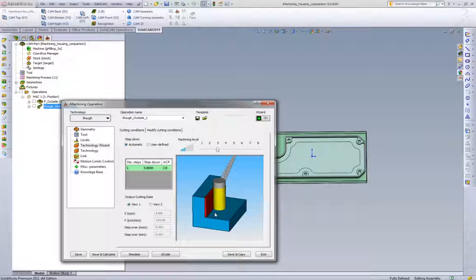When does the tool make the most heat? When it goes into the corners. We've all seen as the tool path runs into the corner, you can see it smoke up. We've all basically had the coolant just dripping on it, and we know as it's cutting around the outside, it's nice and fine. As soon as it goes into a corner, the tool starts to smoke and the coolant evaporates. Because the heat generated in the corner is what's dictating the entire tool path for us.